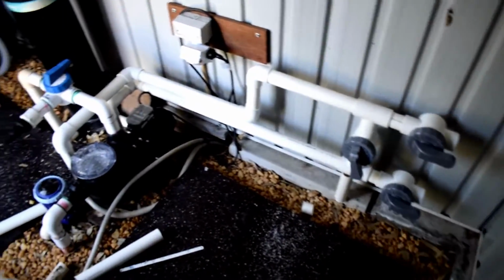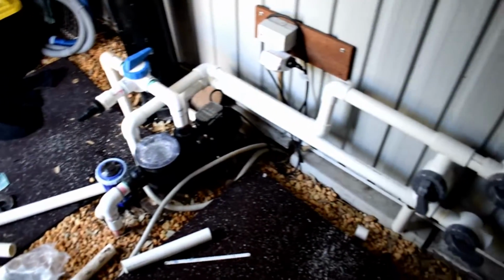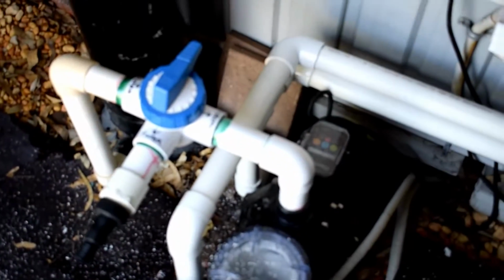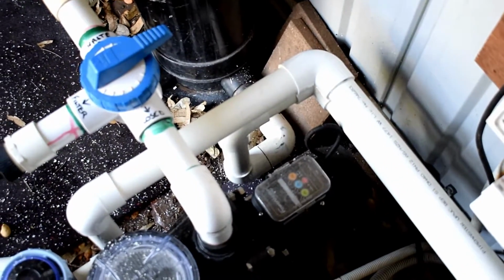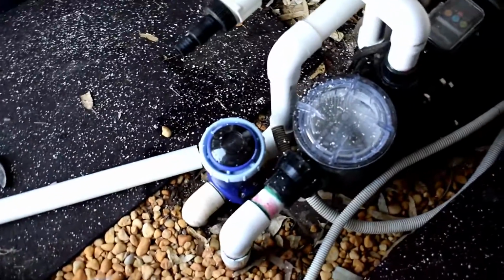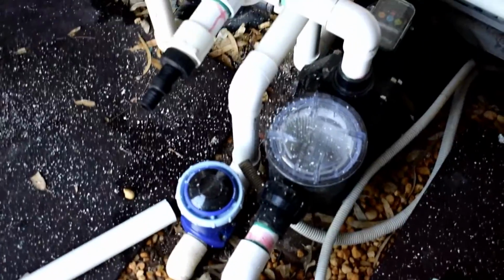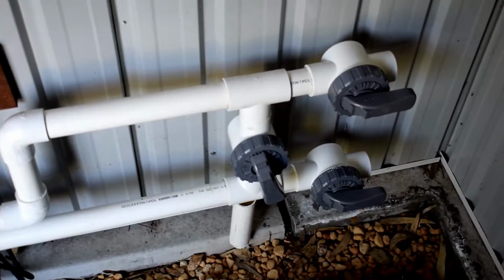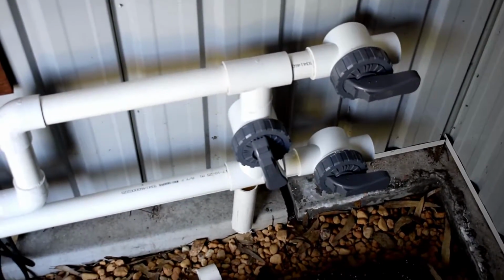Alright, so as you've just seen in that time lapse, I've just created this plumbing here. So I've broken out the pipework from next to the pump. It originally went from the back of the filter over there to inside of the silver Nature 2 stick infuser. So we've cut that piece of pipe out in between, 90-degree elbows up and out from both, and then along the wall over here and into the H bridge. So I've tucked that inside the shed to keep it nice and neat.